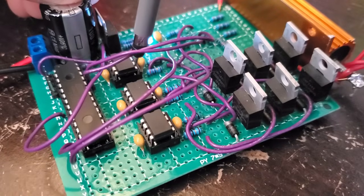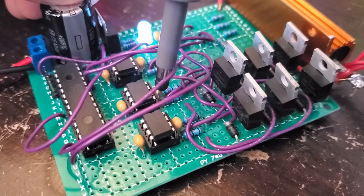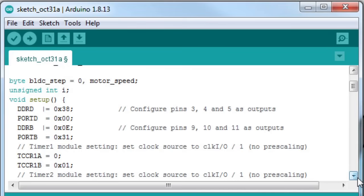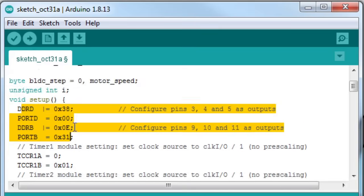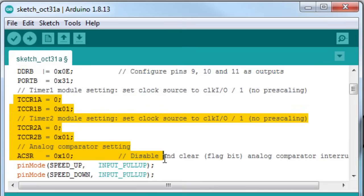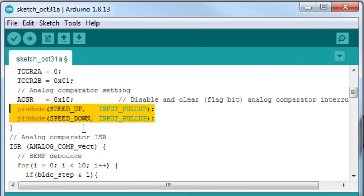At this point I had all the board hardware in place, so I loaded some code onto the ATmega chip to test out the driver. I didn't write this code and I'm not much of a software guy, so I won't get too deep into the detail of it, but I'll briefly go over what it does. A link to the source is provided in the description. This part establishes the input and output pins — note that this is done by directly commanding the registers on the chip instead of using the pin mode command. The next part sets up the timers that'll be used for PWM throttle control, and the analog comparator interrupt that'll be used to force the program to drop what it's doing and change the switch state when a zero crossing happens.